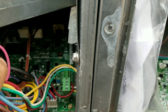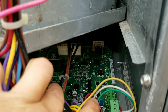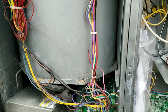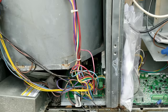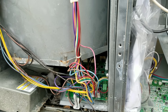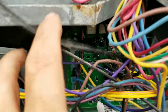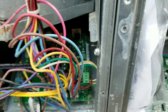Like I said, this unit has thermistors — it doesn't have a defrost thermostat open-and-closed stat. It's going to be kind of hard to see, but these two brown wires and these two black wires are a coil sensor and an outdoor sensor. So I'm going to unplug that molex back there — they are 10k ohm resistors. I'm going to take that out, get my ohm chart, and ohm both of those sensors out to see what kind of resistance we're reading and make sure the resistance is correct.